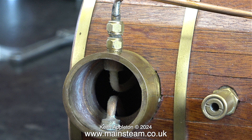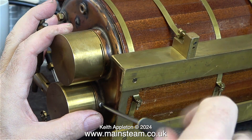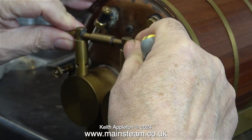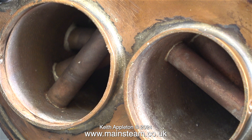This is an overview of the boiler. I'm not going to get into too much detail in the first episode. I want to have a look at what type of ceramic is in the burners, so here I'm taking out the screws that hold the burners in place — two steel screws for each burner, and that's a good idea. I was once playing with a Mack Steam boiler, which was a very similar design to this, and when I lit it there was a loud bang and one of the burners blew off and shot across the room. It was only held in by one brass bolt, which sheared with the pressure of the explosion. I'm very impressed with the manufacture of this boiler. This is quite like the Stuart HB6 boiler that I used to have, except this has two tubes, and if you look carefully you will see that the water tubes radiate — they're not just simple cross tubes.